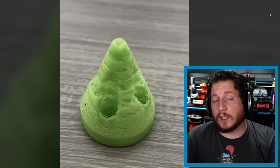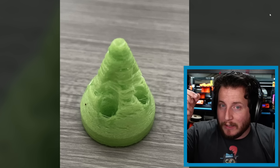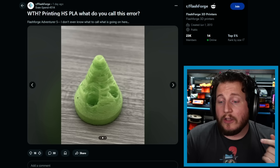A great way to solve heat creep is to print multiples of these parts at a time, or add a purge object so the machine is always moving filament through the hot zone. Also check that the extruder gears aren't clogged — use a dental pick, O-ring picks from Harbor Freight, or firearm cleaning brushes on the short-bristle side, which work great for cleaning extruder gear teeth.